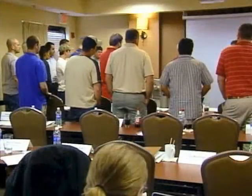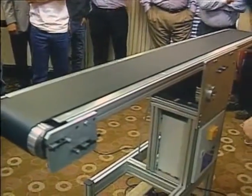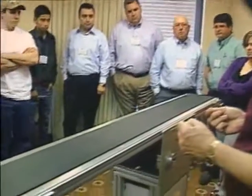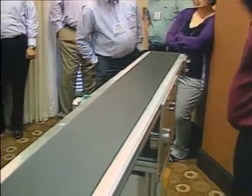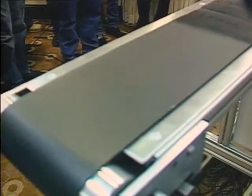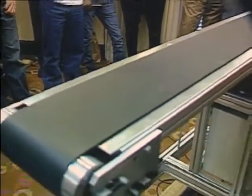This little conveyor — and I'm going to invite you all to come up and take a look — this is not a head pulley/tail pulley typical drive system. This is a center pulley drive, specifically a center pulley drop center pulley drive. Your belt is coming around and going down around that drive pulley, coming this way and going around in that direction.